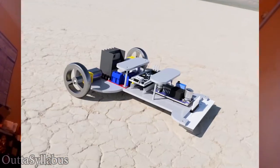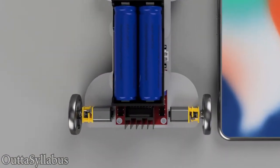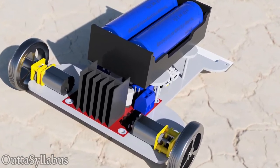First I want to give a brief overview before going to the actual build. While I was struggling with my previous bot, I made this CAD model — just a prototype using genuine Pololu parts. We have the Pololu motors with wheels and a QTR8A genuine Pololu sensor array. Obviously those are CAD models of the actual components. I also used two lithium-ion batteries in the design.